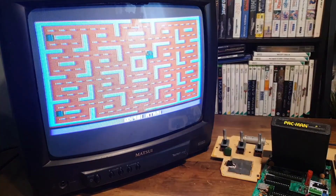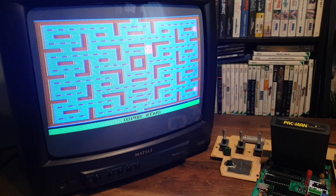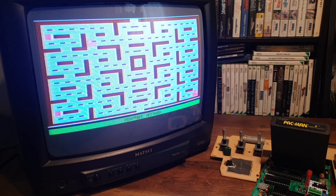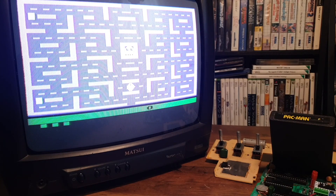With those two wires in place — perfect. And look, Pac-Man doesn't auto-start anymore. With the CD4050 no longer on the border of input hysteresis, Pac-Man doesn't see the CX10 button pressed at boot-up, so the game no longer auto-starts. This is another piece of evidence that this fix is how the console was supposed to be designed, and the lack of power was just a mistake.